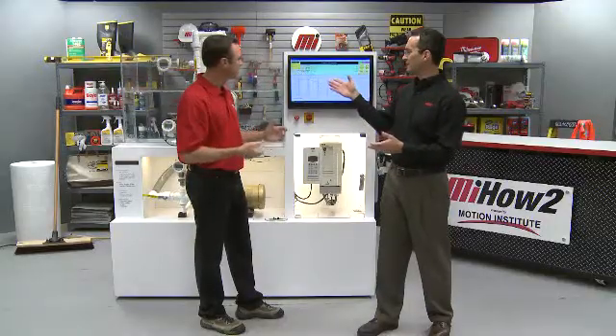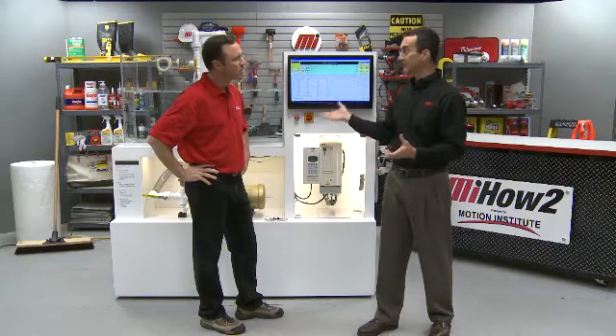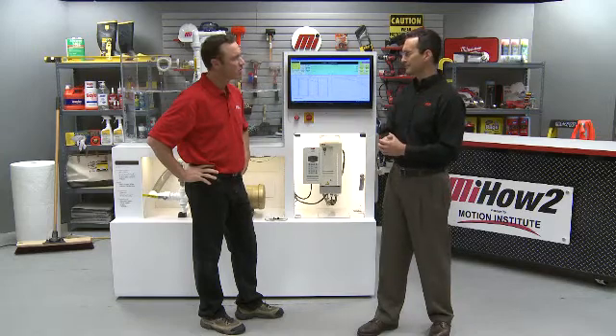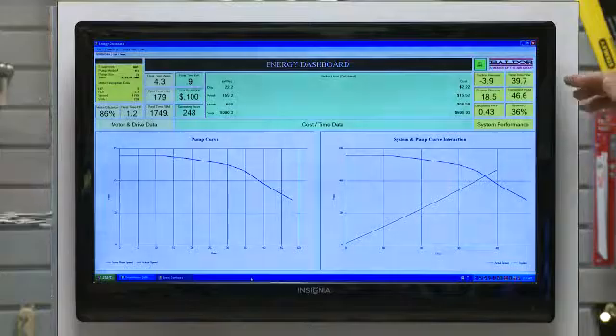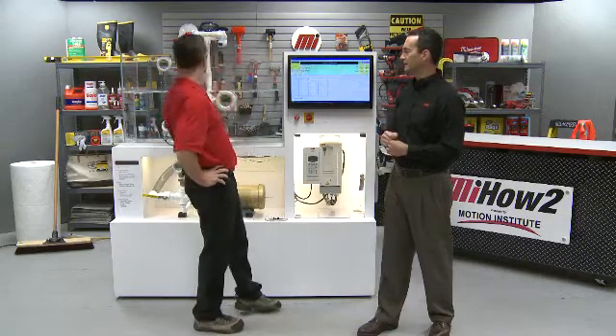Too often what happens in a processing facility is a pump comes in standard sizes and standard ratings. So if you go and buy a pump it's rated to run at, let's say, 40 gallons per minute. You can see that here on the energy dashboard we are operating at 40 gallons per minute, with that yellow valve fully open. But most applications don't require the maximum the pump is designed to deliver — about two-thirds of that flow is pretty typical in industry.